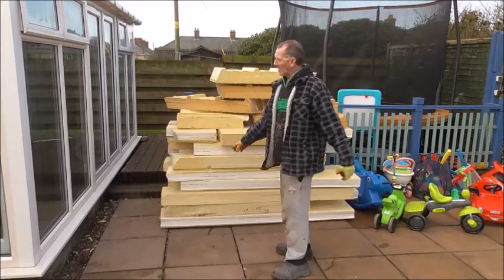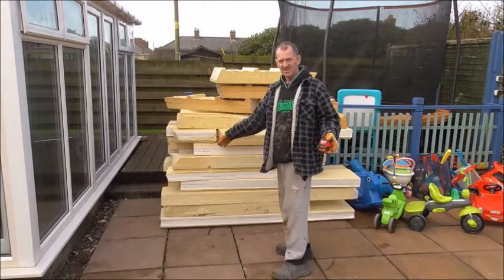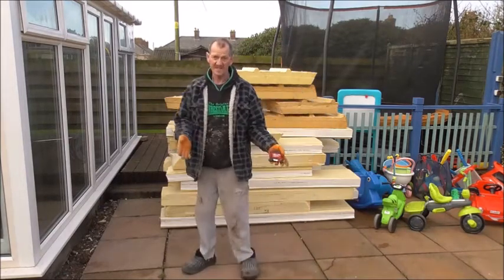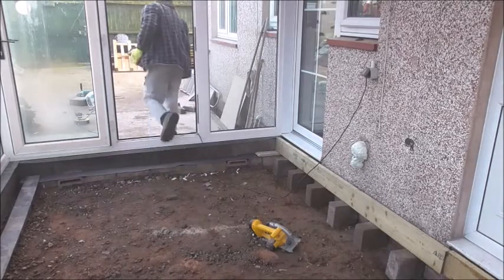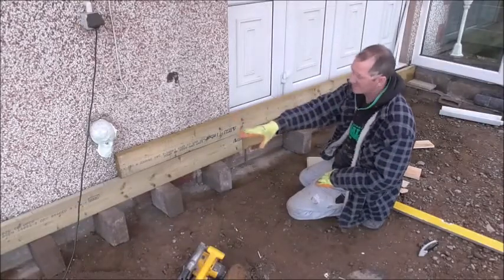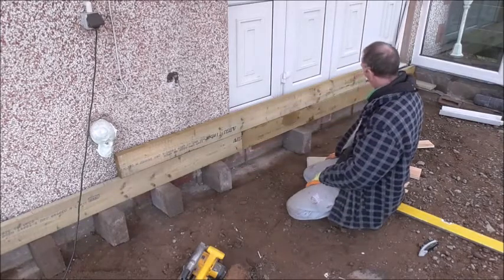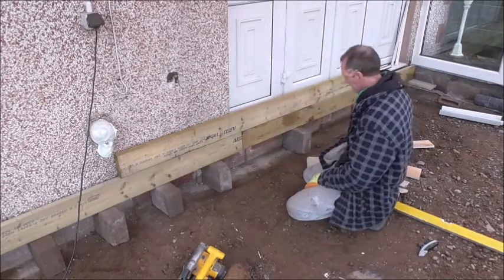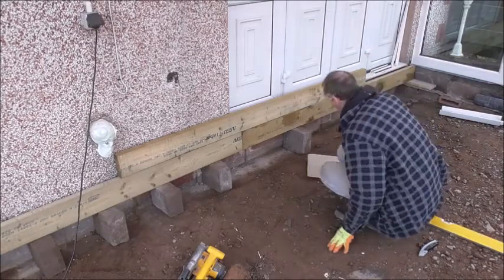Right. But what I've got to think of now is the joisting spaces, normally 400 centres, they're not. They're going to be what this needs. So I'm going to have spaces of the gap between a 310. Let's put them closer together slightly, so it's going to be a stronger floor, so we'll not complain about that. You've got a joint going on like this, it's useful to put another piece on top like that. It just shows you that the whole thing is level with itself. Works a lot better than a spirit level because you can see any gaps that's going on over the whole length of it. Now I will be putting a plate across these just to brace them. All helps. Not necessary. All helps.